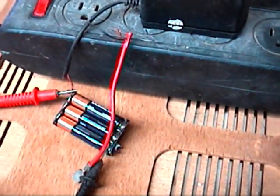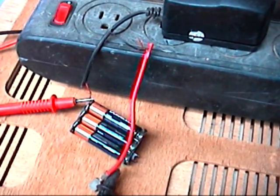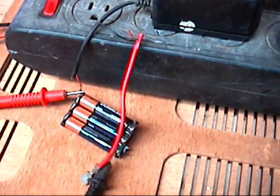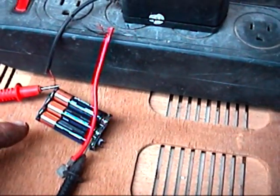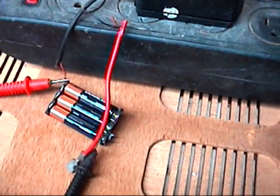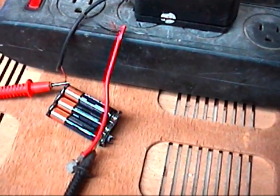If you had a battery bank with 6 slots, 6 batteries would be almost 2 volts each, so that would be like 10 volts. You could put a 12 volt charger together and charge about 6 of these. If you have a 10 or 12 volt charger, you want to string up more batteries together in series to charge them up, and you can charge more batteries that way.